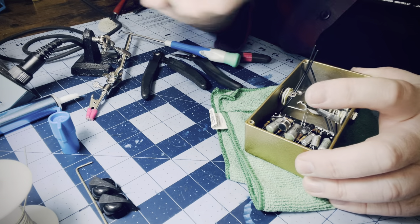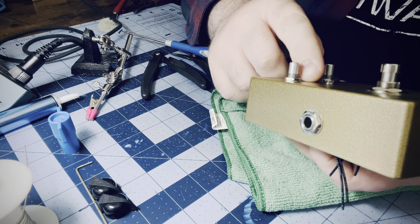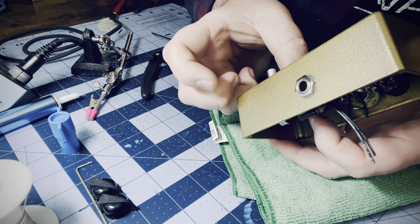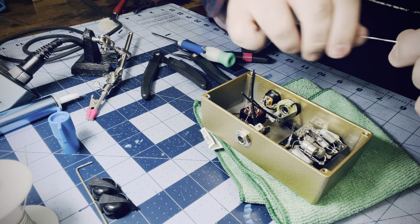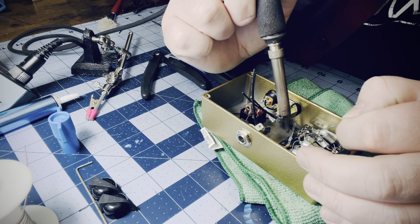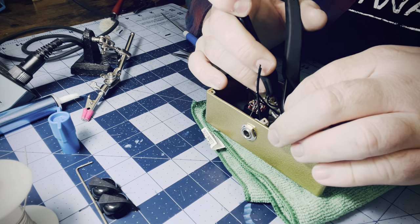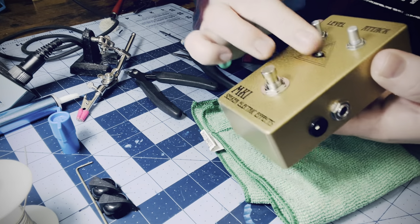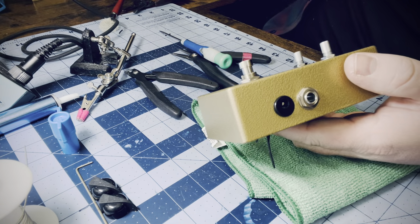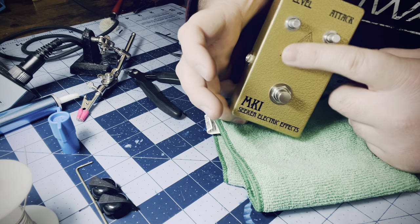For the LED, it's flat on the top and I like the idea of it sitting flush with the top. What I'll usually do is put a little piece of blue painter's tape over it, make sure it's flush, and then solder it from the back. Remove the tape — it's nice and flush on top, doesn't stick out, and it just looks kind of cool. It doesn't clutter the pedal design. It's really simple; I really like that.